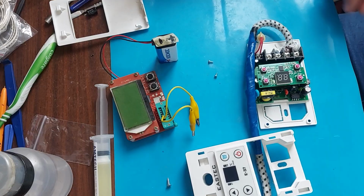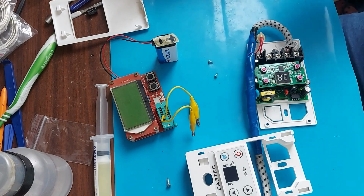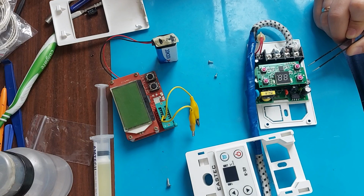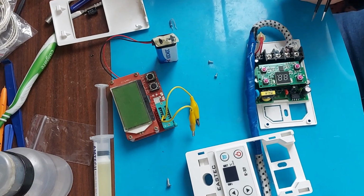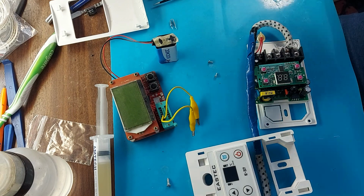And so guys, I replaced this resistor with a 10 ohm one, only it has less power and it itself is smaller. I hope it will be enough to test this device. In the future I will replace it with a larger size. So I tried to turn on the thermostat again and it didn't turn on again.